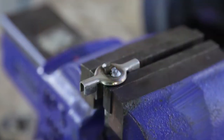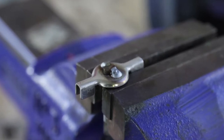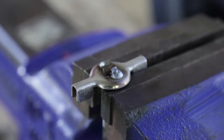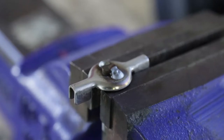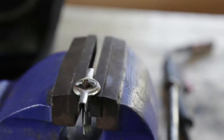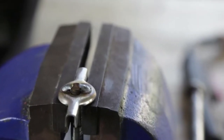This little part in my vise is from a bread maker we've had. When it came from the factory there was just a clip joining the butterfly-type piece to the shaft, but that loosened up and eventually broke. I just popped it out, brought it to the shop, put a couple of spots of MIG weld on either side of the shaft where it meets that butterfly piece, and it's worked well for years. It's just a perfect repair and didn't take long to do either.